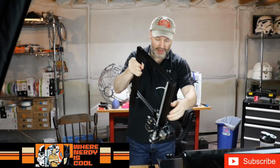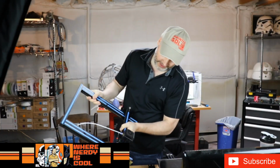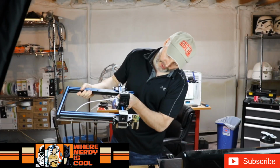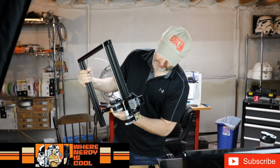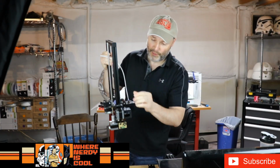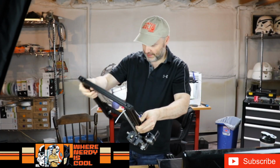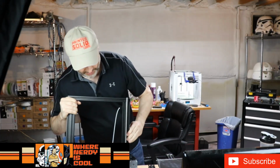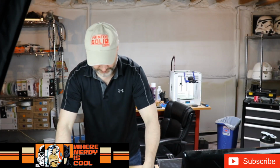It's interesting how this is all ventilated. So we have a single part cooling fan that's going to blow on the front of the nozzle. It's interesting how it does have on the side here a mount for an auto level, probably a BL Touch. And there's the QR code for Geeetech and everything else. But so yeah, largely this looks very much like a mini CR10 so far.